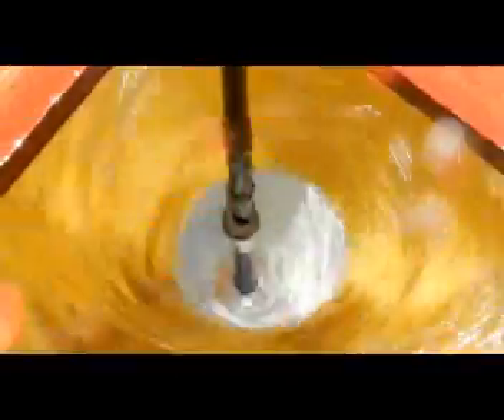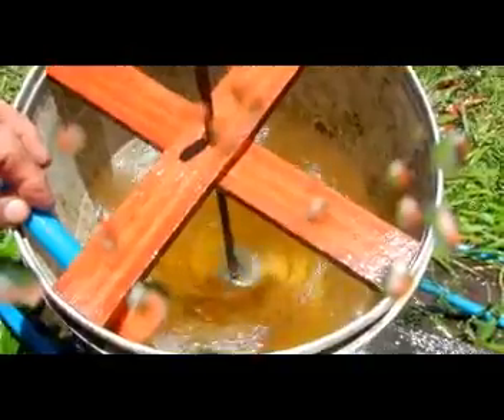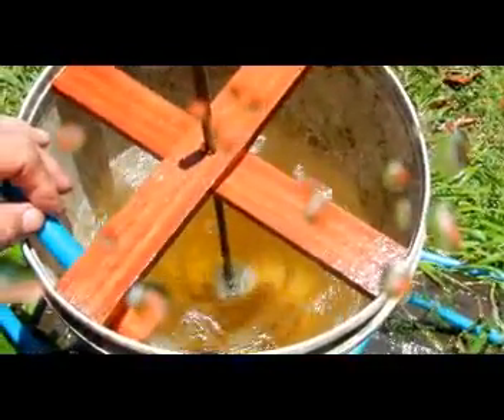I've got to be careful — if I let go of that hose it'll spray the camera. There we go — everything's spinning. There's not much torque because we're only dealing with a very small amount of water and a very small turbine. But if you can imagine this at a 10 times scale, you've got a fair bit of weight in the water alone loaded into those blades. It's a very simple idea. So there we have it under tension, under load. I counted it before with a stopwatch and I was getting 175 revolutions a minute. My mate in Barley is getting 350 out of his impeller, but this is not bad for a first effort. It's Victor Schauberger's vortex technology.